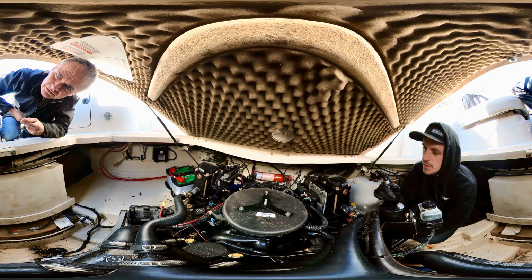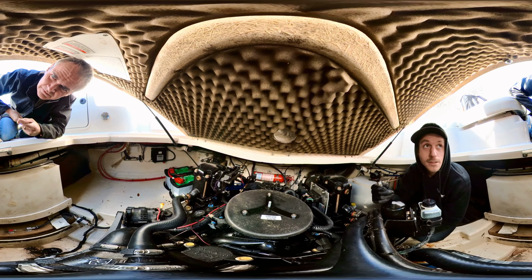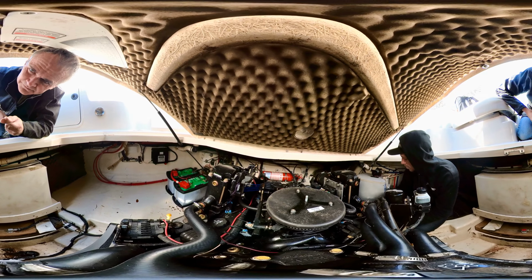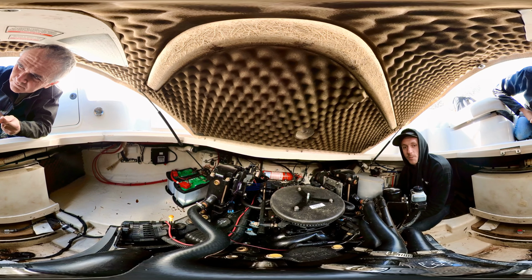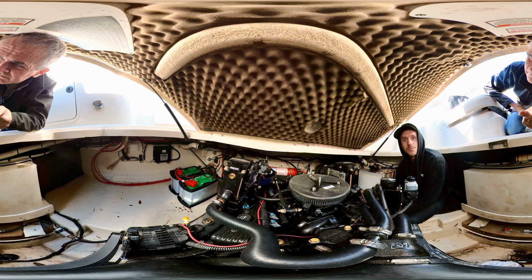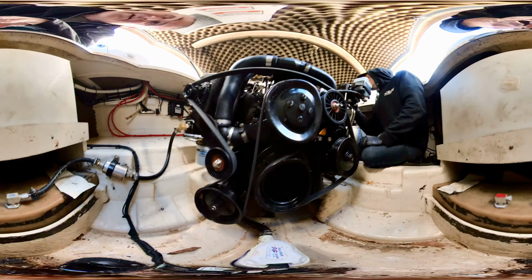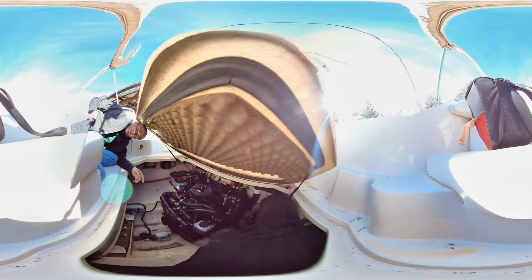What you don't want to see is a ton of carbon buildup or black sooty deposits on it. If it's white, that is a sign of pre-ignition, like the ignition timing would be off. That's when stuff starts to get hairy, because that's a lot hotter mixture, and then you start melting tops of pistons. Pretty good.